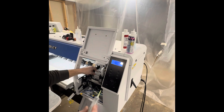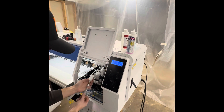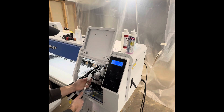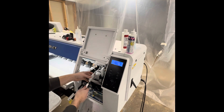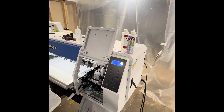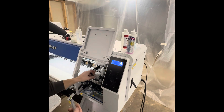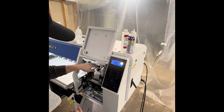The second thing after the white circulation system goes is I prime the dampers. I'm not priming the dampers because there's no ink in the dampers — I'm priming them because I want to get fresh ink inside of them, ink that's been mixed up. And I'm not going to throw this ink away. I'm going to save it in this little cup here.